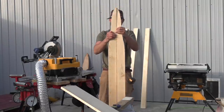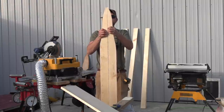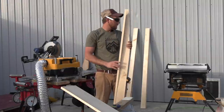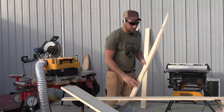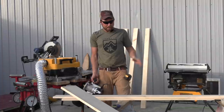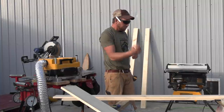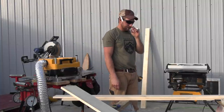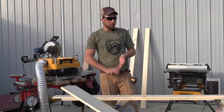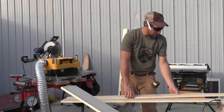There's our coyote board for the most part. Now I want to go ahead and round over everything. I'll take my big router on the outside edges especially — that's the important part — with a big round-over bit, then touch everything up with my trim router using a quarter-inch round-over, just to make it look nice. Then we're going to address the bottom to fasten this split board together.